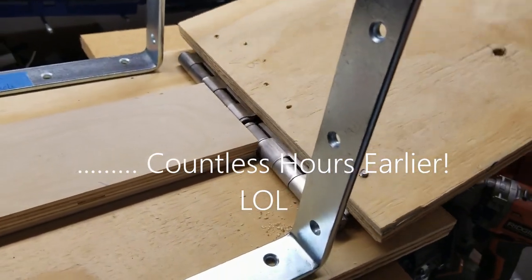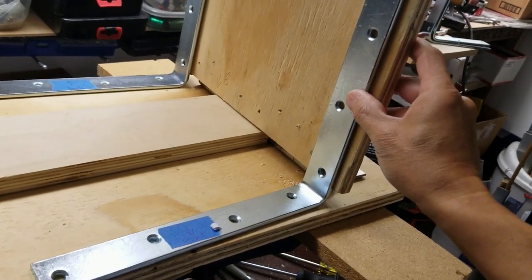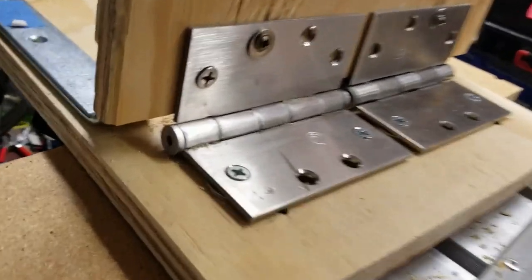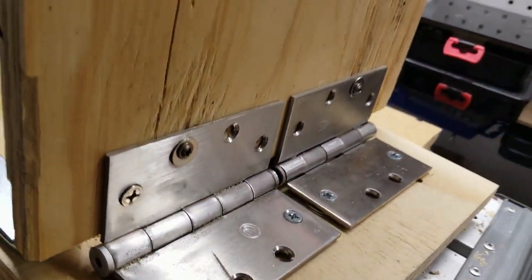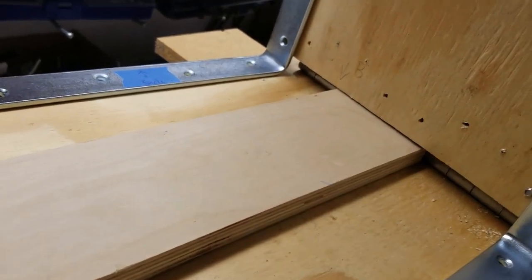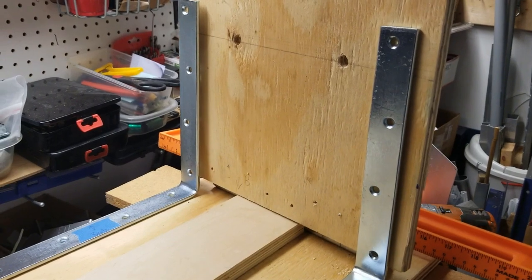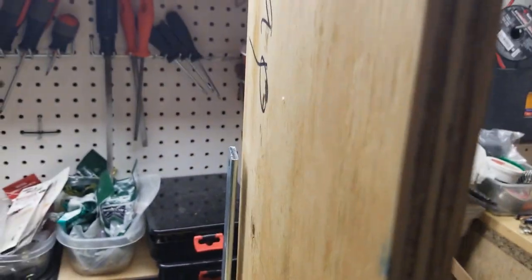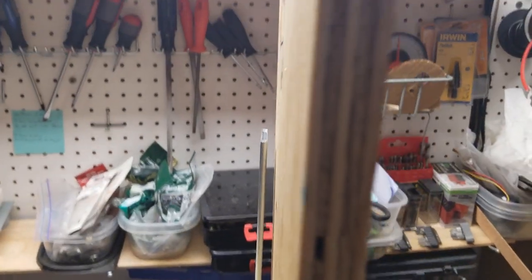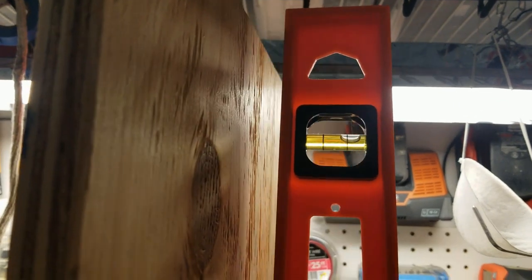I've got the hinges already put on as a template. As you can see the backboard can now flip up, and I'm planning to secure it vertically and mount it to the baseboard so it can stand up. There's the hinge with a couple of screws to hold it in place while I size and measure everything. Washers underneath just to level it up. There's a one-inch piece of scrap wood to keep it vertical from flipping over. I decided to use 10-inch right angle brackets from Home Depot - I had to work them straight a bit on the vise, and they'll eventually be strapped down to pull the backboard super straight and level.